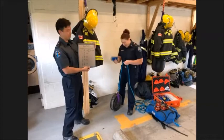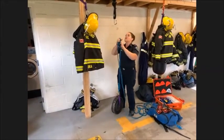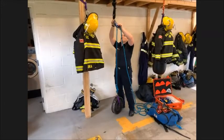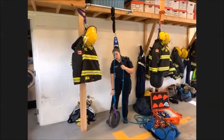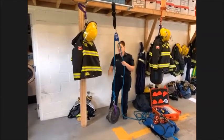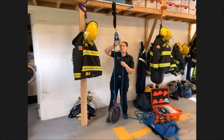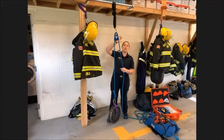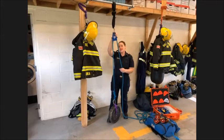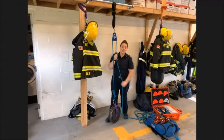So now, if I add a pulley, see what happens here. I'm gonna put this rope around my pulley, and I'm gonna hook up my pulley up here. So my rules, my knot is at my load, it's an odd system. My last pulley, that was my second rule, where's my last pulley? So if my last pulley is up at my anchor, it's actually not giving me any benefit. It's not giving me any mechanical advantage. It's what we call the change of direction.